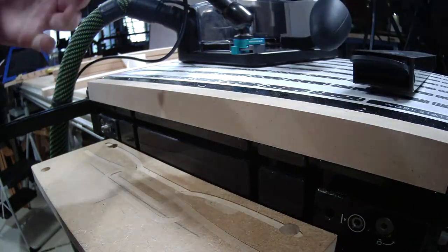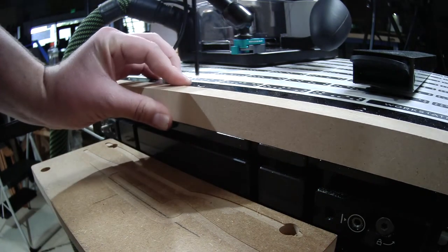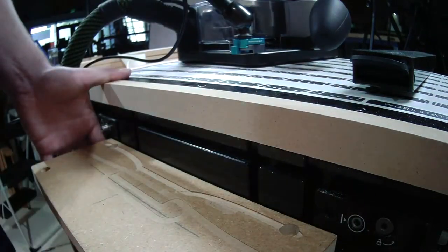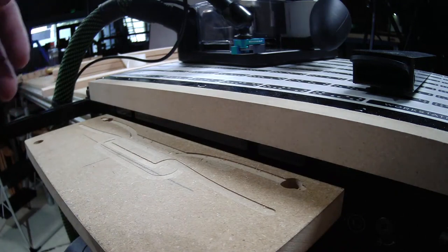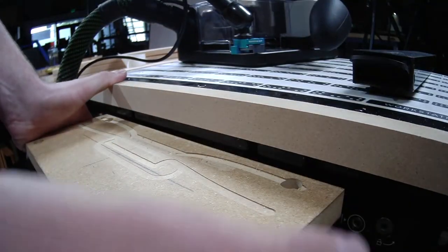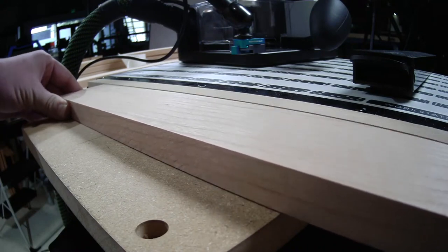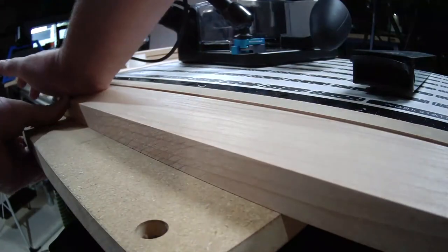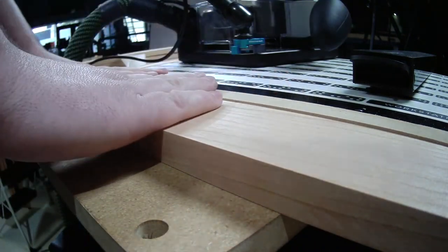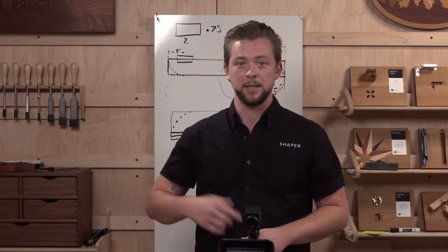Now I can slip in a spoil board. And dial that in. All right. Now we're ready. Double-sided tape down. Bring it up a hair more. As long as I'm pressed firmly forward and aligned to that edge, I'm good to go. Now for this first one, I want to be extra cautious and make sure I'm getting everything nice and tight, because I'm only making one grid, and that's it. One grid, one scan, and just replacing my material from then on out.